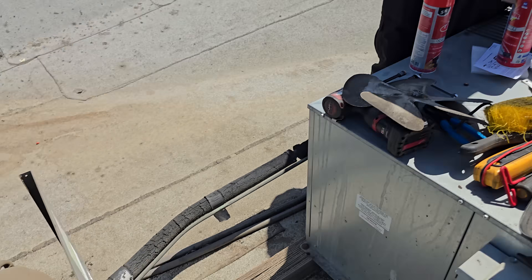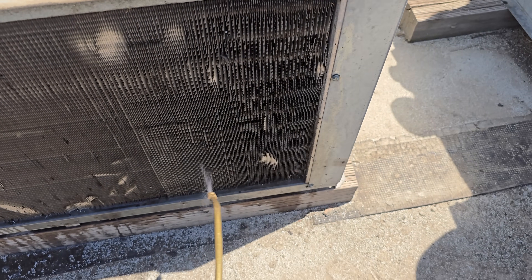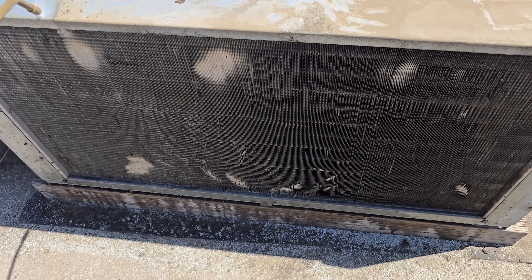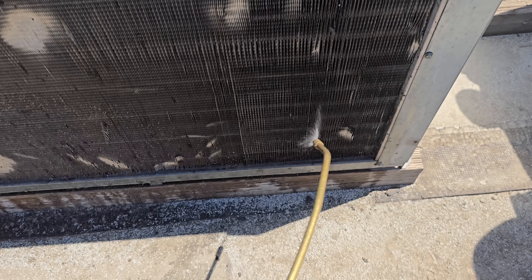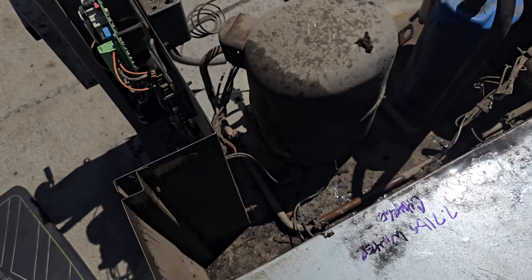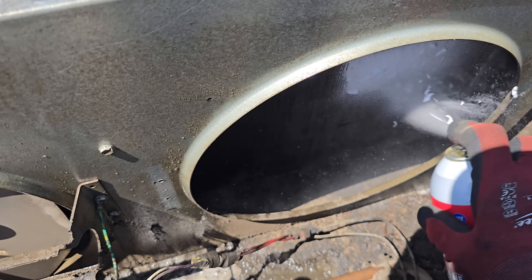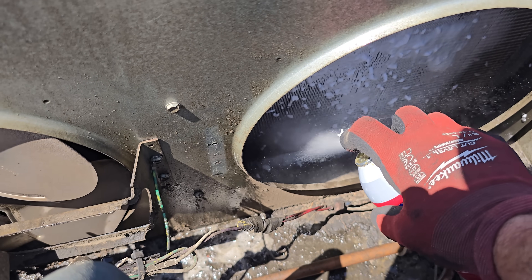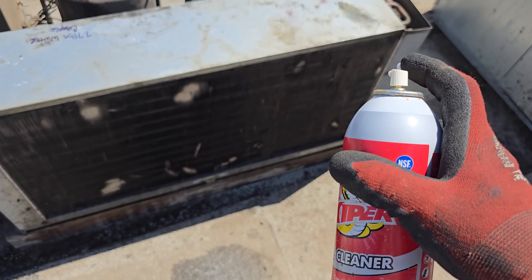We've got a motor over there getting ready. I'm going to give this condenser a rinse first. We didn't bring hoses up - just a pump sprayer - because this thing doesn't look too bad. We'll clean it from both sides. First step is to get it nice and wet, get the bulk of the big stuff off from both sides. Then we'll apply a little cleaner so it has a good working surface. We're going to use some aerosol cleaner - I have two cans that are basically half empty. I'll spray it in here; this one's almost empty but I'm going to use it up, then we'll use the other one. Just let it get on there, it'll foam up, and we'll get it from all sides.